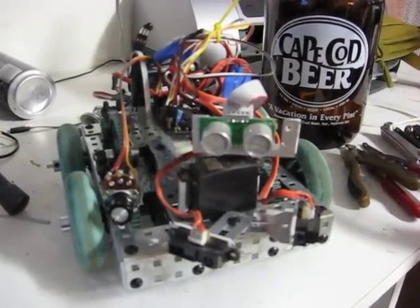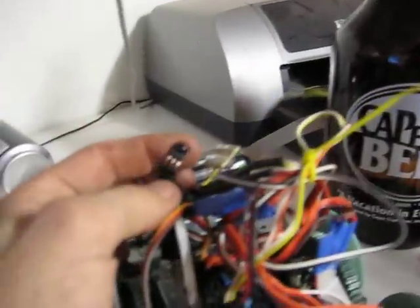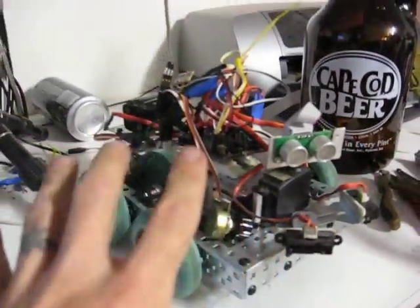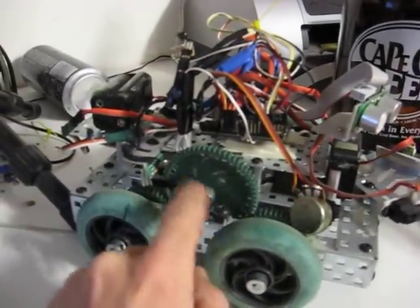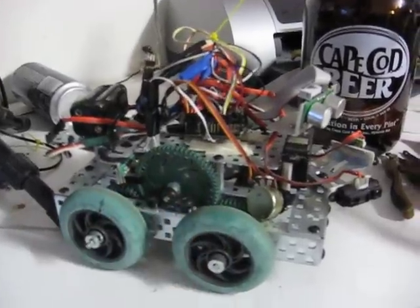There's a good first test. The next thing I'm going to do — because I've got an infrared sensor up here and I'm running an encoder shooting through these little holes here — in theory, I'm going to try to run the robot off of wireless remote control and have the EEPROM record how far the wheels have traveled. So I can drive it around using my remote control and basically have the EEPROM map the entire route and know exactly how far everything's gone.